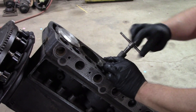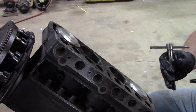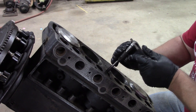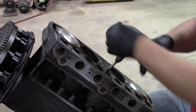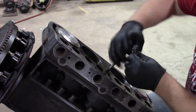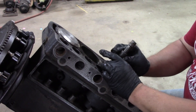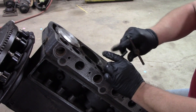It's turning sort of hard, but we're not taking any metal — it is just carbon, burnt oil. So you just go a little ways and then flush her out a little. See where we've been — it goes super easy, one finger. And we'll also watch the depth of our tap to know we're not fighting the bottom. Right now it's turning kind of stiff again. Sometimes you can rock them back and forth and back her out. Just take your time. Let's take our drill bit and see what we've got in there.